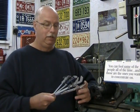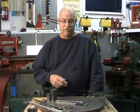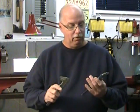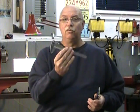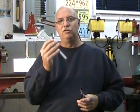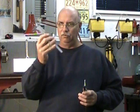In my little home shop I have four different vernier calipers. Let's look at these two six-inch models — one with a vernier scale and one that has a digital scale. These two basic shop tools are almost a must-have — one or the other, you don't need both. Each one has its little advantage. The vernier scale model's main advantage is that it's ready to roll — there are no batteries. This thing is always good to go, which is a big advantage for someone like me who doesn't pay much attention to buying batteries.